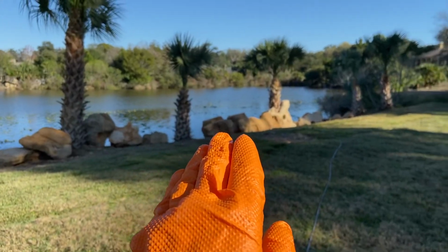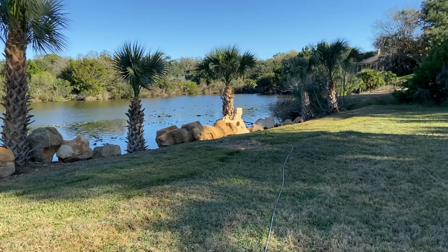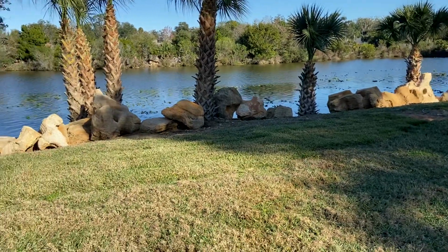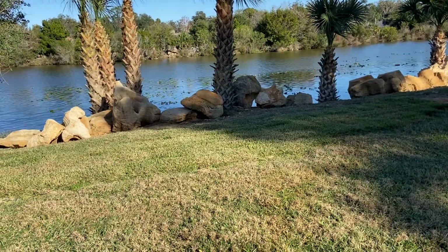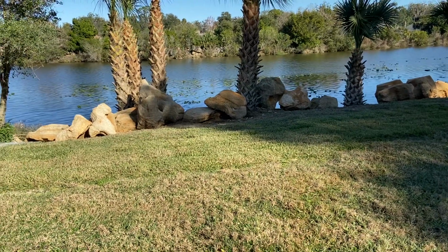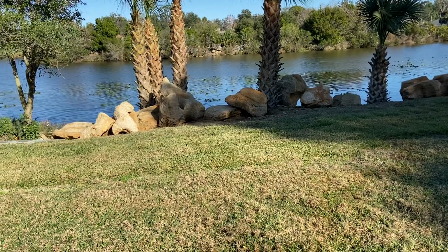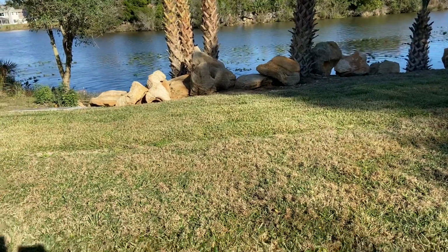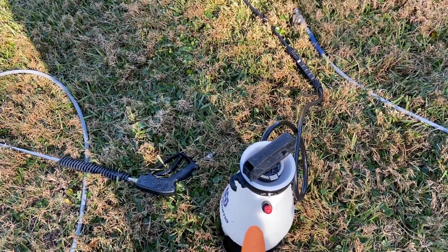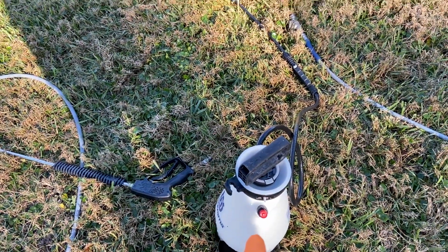That way I knock off all the dirt, the debris, the moss, all that type of stuff. I'm watering the ground as well. And I'm allowing this very porous, shell-like coquina, because that's basically what this is, to begin to open up and to accept the solution. The solution is a very, very, very hot mix of surfactant and sodium hypochlorite.